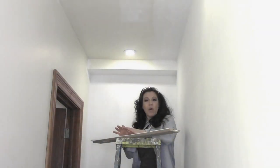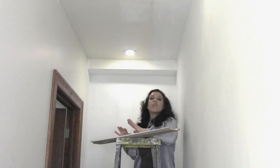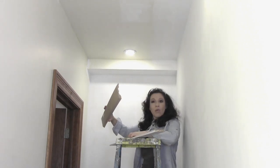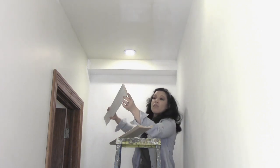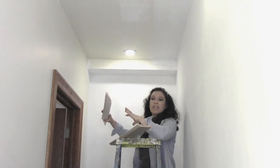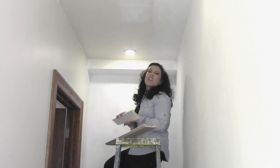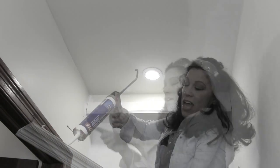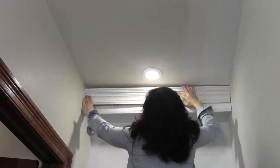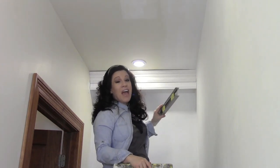Now that the carpentry work is finished on the wine rack, I'm turning my focus upward to this odd little soffit above the area. I want it to look more purposeful — like I intended it to be there. I'm going to do that with a nice piece of beefy crown molding, but it's not quite big enough, so I'm adding another piece underneath it, which is just a piece of baseboard. This is what professionals do to make crown molding look bigger than it really is. I've cut it to length with straight cuts, gluing it in place. When I stood back to look at it, I realized my ceiling isn't level, so I needed to readjust — and that's a great reason to use glue instead of nails.